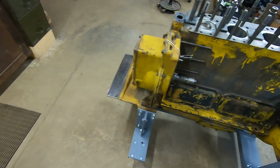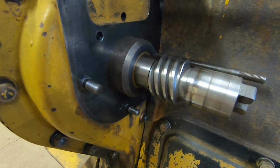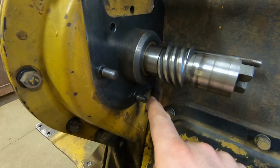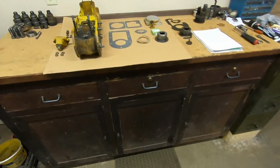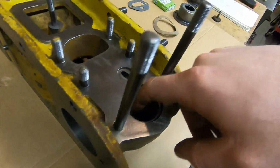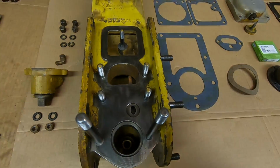Now, where the oil comes from to provide the lubrication is anything that gets pushed past this accessory shaft bushing from that lube circuit that's under pressure that goes through that shaft. Excess oil is going to come out the end, puddle down here. The fuel pump drive gear will pick it up. It'll lubricate the worm gear, and you want to make sure you get that hole put in that gasket so that excessive amounts of oil do not back up in this compartment in here. Make sure that passage stays open so that it can self-regulate and maintain the proper amount of oil.